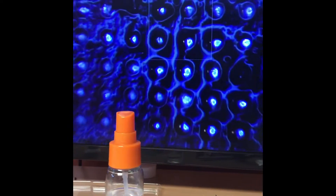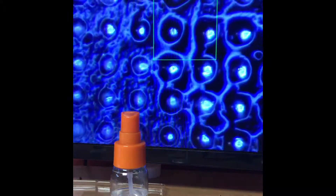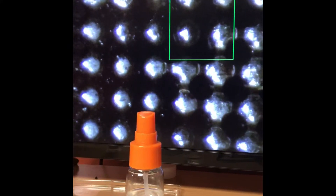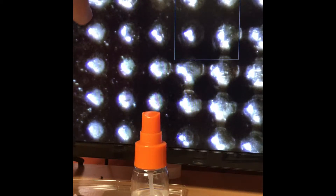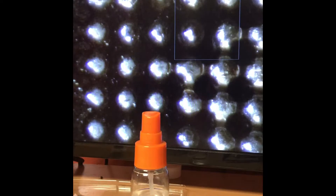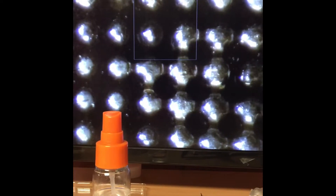We're doing the reball for the chip — it's nice and beautiful. After I clean the traces on the board and take the audio chip, I added the jumper. You can see the trace — this is my jumper, the third one. I took this trace from here to this small transistor or filter, and then we're going to put the audio chip back.